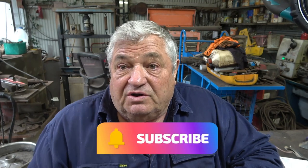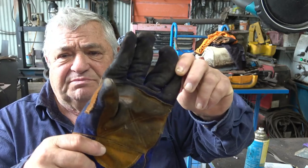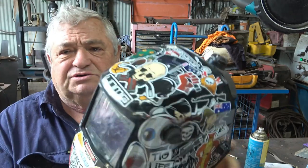I suppose the first thing to consider is that potentially any welder can be dangerous, and we have to think about personal safety. If you treat the machine incorrectly, there's danger from electrocution. And the other thing is, of course, you're dealing with molten metal, so the potential to get burnt is there as well. The first thing is to consider long sleeve shirts at a minimum, gloves to protect your hands, and of course, a face shield so you can see, and also to protect your eyes.